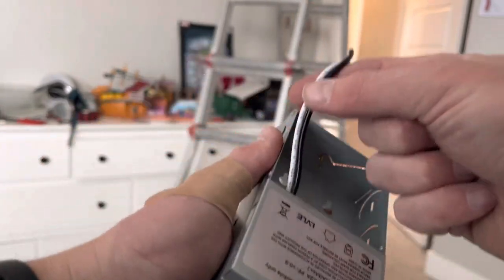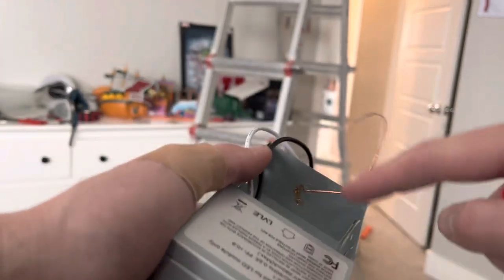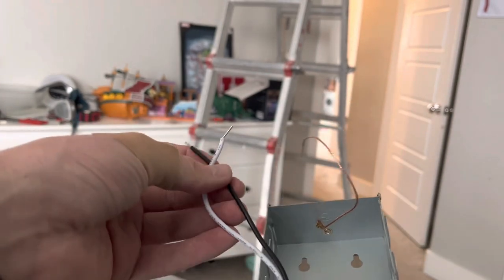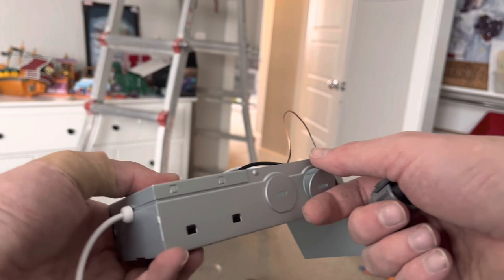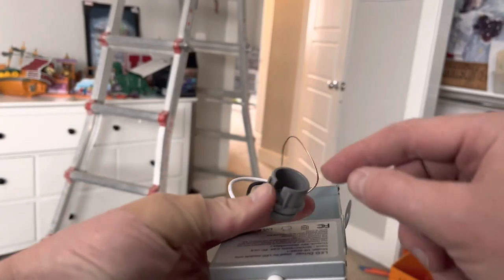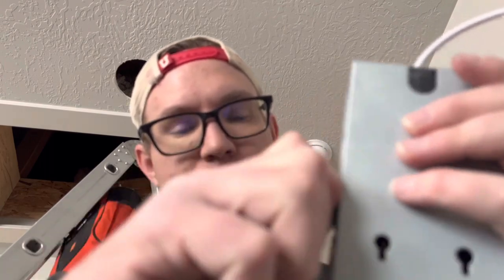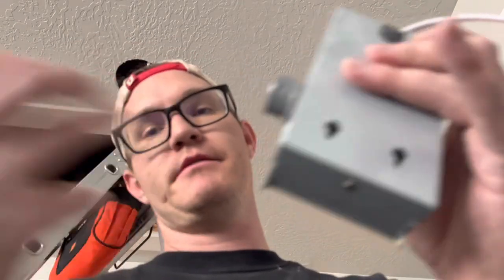Each light comes with its own junction box. You can see it's got three wires. The copper wire is already grounded to the box, so I don't have to worry about that. When installing the wires, you connect copper to copper, white to white, and black to black. The white are the neutral, the black is the hot, and the copper wires are the ground. On the sides you've got these little pullout tabs — whichever one you want to knock out, you just knock that out. I've got these little wire protectors — basically one-way protectors. You slide the wire in through there and you're unable to pull it back out, as it clamps down on the wire. That protects the wire from rubbing on the metal and keeps the wire secured in place.